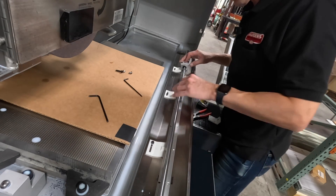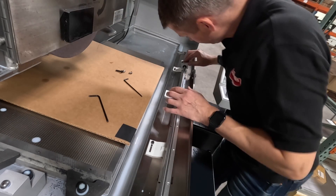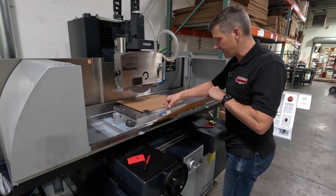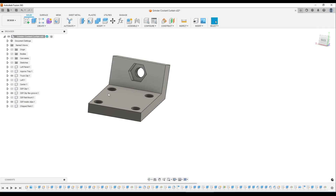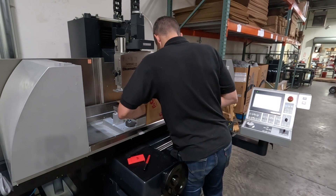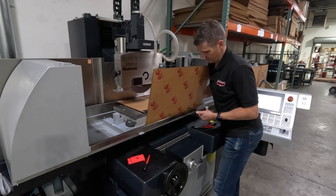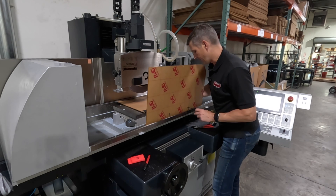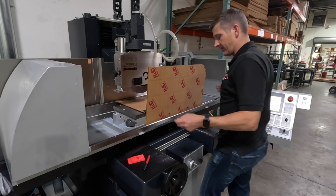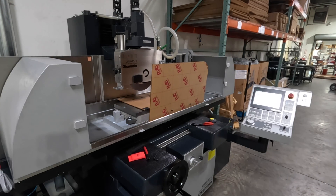That's the one thing I don't love that I'll have to address. Printing threads is usually not great, so 3D printing a hex and sliding an actual metal fastener in tends to work well — except when the nut falls out the back. I went with acrylic; I considered Lexan, but I'm not looking for the safety aspect here, and acrylic scratches less easily and was cheaper. Fail fast, fail cheap — if I need Lexan it's easy to reorder in a different material.